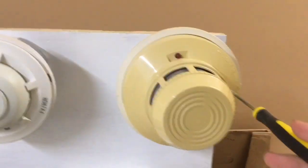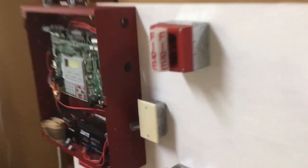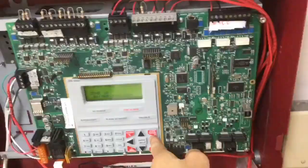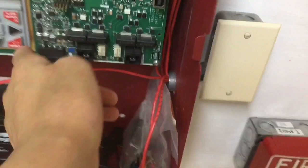Push it in. I don't really have a way of testing the heat detector because I don't have a hair dryer on me at the moment, so I'm just going to go ahead and use the test switch. That's why I always put heat detectors here — it's convenient. That obviously works, and now we can go ahead and do a system reset.